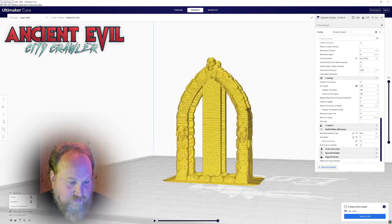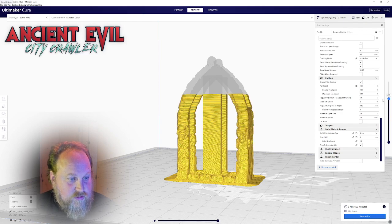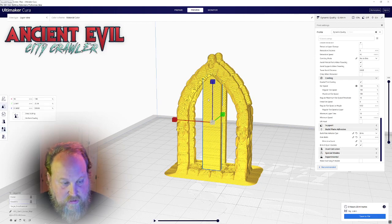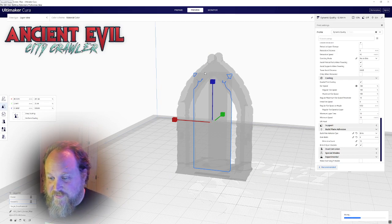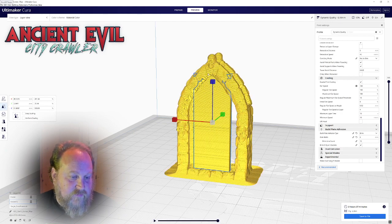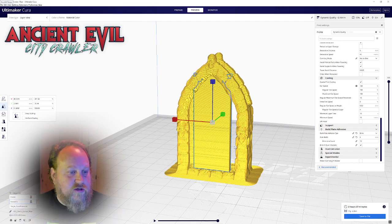You can see the little air gap in the supports. So those things should come off pretty easy, but it will give you a little bit of extra juice in there. If you take these pieces and you scale them like this, you'll see here, it'll try to print those as support pieces on top. It doesn't really detect the inside of it, but that's kind of okay. What you would do in this case is build a piece in the middle, and then put two thinner pieces on the side that were a little bit shorter, and you would deal with the arch that way.